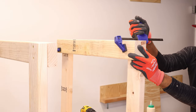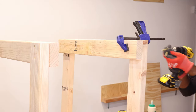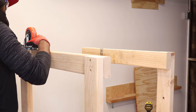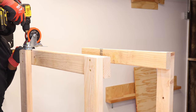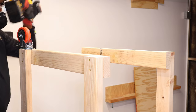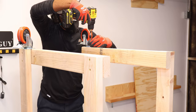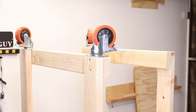We're going to clamp the other side — same method: use the mallet to tap it down, then use the clamp to hold it in place. Now that we have the bottom supports in, we're going to put in our casters. I like to use these cabinet screws because they work really well and I don't have to worry about additional washers. Because this is just a cart, it's not going to see a ton of weight, so these cabinet screws will be more than fine. I also try to drill them in at an angle to ensure that I don't split my lumber, otherwise I'd have to take that piece off and cut a whole new piece. Here you can see a nice close-up of how I'm drilling at an angle.